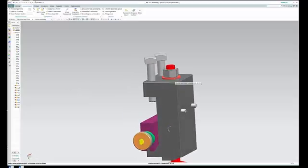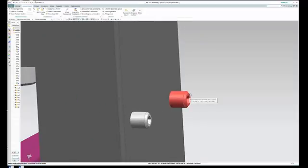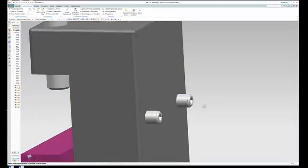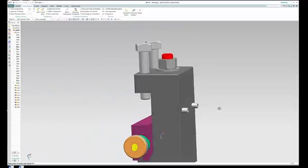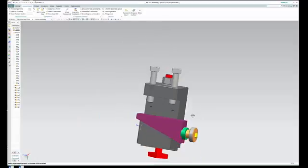The nut and the washer should stay on the bolt relative to the tool body. They should not move, and I don't necessarily want these two pieces to move. They are centered on the holes, but I don't want those to move, and I'd like to have a distance of 1/4 of an inch from this outer face on this hex socket head set screw to the face on the tool post. So 1/4 inch on that, I believe, is what it calls for on the instructions. So that's basically how that thing goes together.